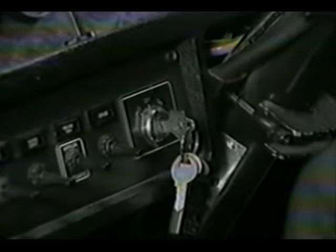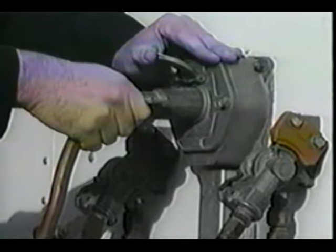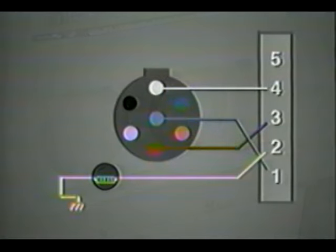The Easy Stop ABS is powered from the tractor's ignition switch through the auxiliary pin of the 7-way connector. Power is also provided to the Easy Stop ECU through the stoplight circuit. The stoplight circuit is used as a backup if the auxiliary pin is not powered, as is the case with a non-ABS tractor. The power cable for the Easy Stop ABS has four wires.